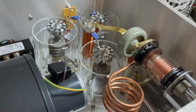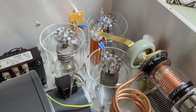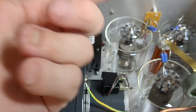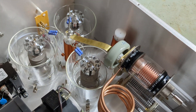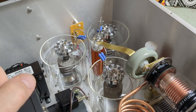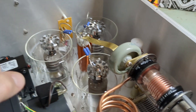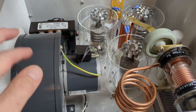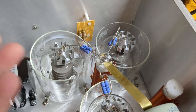I'll give you guys a peek at the inside. You've got a vacuum tuner on the tune side, a nice big heavy-duty load capacitor, and chimneys. This deck has an internal blower so it pressurizes the bottom, cools the pins, blows up through the tubes, and keeps the seals cold. You've got high efficiency plate caps. This is a very nicely made amplifier. To be very frank, if it sells it sells, if not it'll just go on my base — but this is a big key-down time box; you could talk on this thing forever.